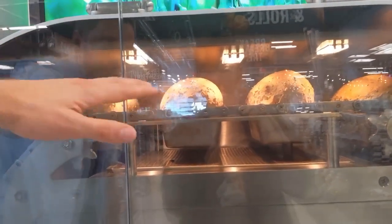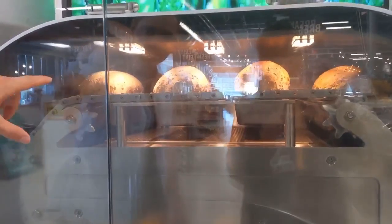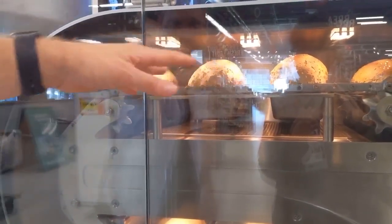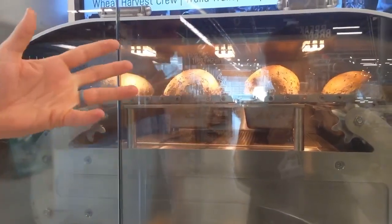There's about 2,500 watts of resistance power in here and it's going to make about 380 degrees. It spends 6 minutes at every location — at the top it spends about 24 minutes, and with the sides gets a little bit too, so about half an hour total.